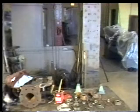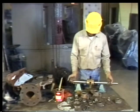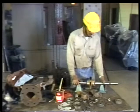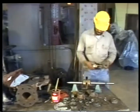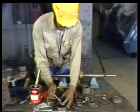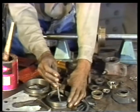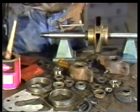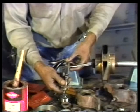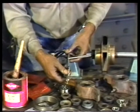Now you can return to the work area and mount the other parts of the rotor on the shaft. Before you replace any of the other internal parts on the rotor, there are two important measurements that must be made. One is a measurement of the distance from the hub of the impeller to the end of the shaft. The impeller must be in the proper position in order to fit into the lower casing. The second measurements you must take are those for the new casing wearing ring clearance. Remember that we're installing new casing wearing rings. And what does our first reassembly rule say? Right. All parts, old or new, must be checked to be sure they're in good condition.